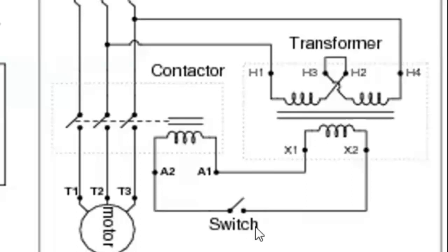If those components are okay, you have your 110 volts at the contactor coil and it will be energized, so the contactor is expected to close. If you have input at A1 and A2 and your contactor coil is not energizing, it means the contactor coil is faulty. Or if it is energizing and the contactor is not closing, it means your contactor is also faulty.